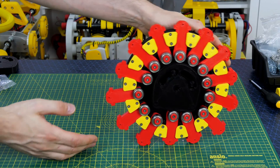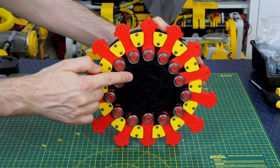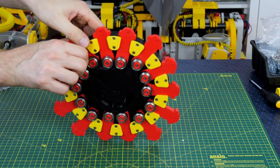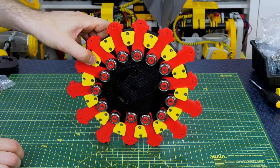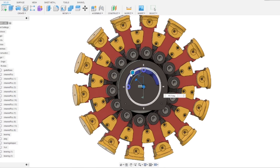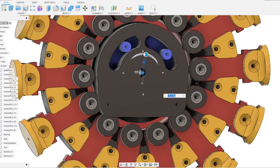However there's one major oversight with the design, which is as the wheel rotates round and round the guide rotates round and round as well, and we can't keep the flat piece at the bottom. That's because we've got one main hub with that base with the two pegs attached, so we need a different design that allows the guide to stay stationary in the middle and allows all of the little feet to move around it.